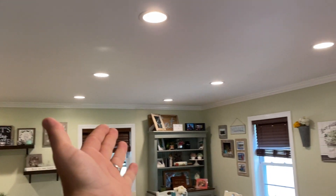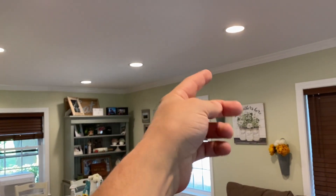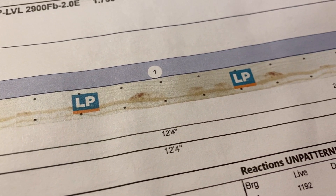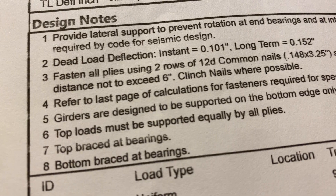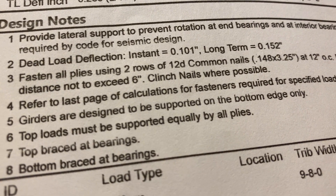The very short explanation of removing a wall and supporting the ceiling or the floor is you need to replace that support, and the way to do that is to put a beam in — then it's going to be supported on one side and then the other. The first thing you want to do is figure out the size of your beam, and that is something that an engineer will do. You give them the measurements from one wall to the other, tell them what it's for — if it's going to support a floor load or an attic — and they will tell you exactly what you need. In my case it was two LVLs, which are laminated veneer lumber, and they even tell you how to bolt it together, nail it, or glue it. Once you have that size, you can bring your plans to the building department. Make sure you pull the proper permits and all that good stuff. Then you can start your job.